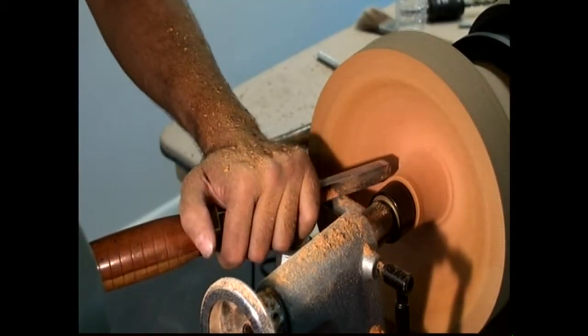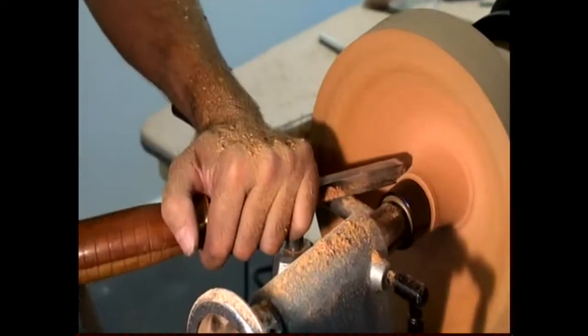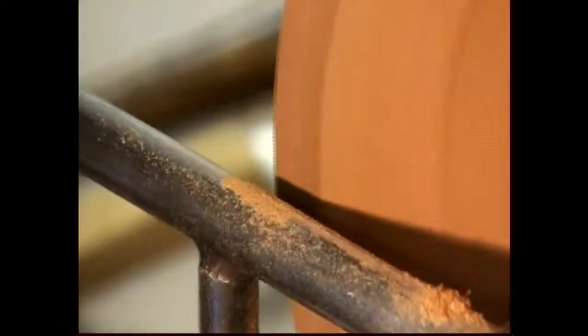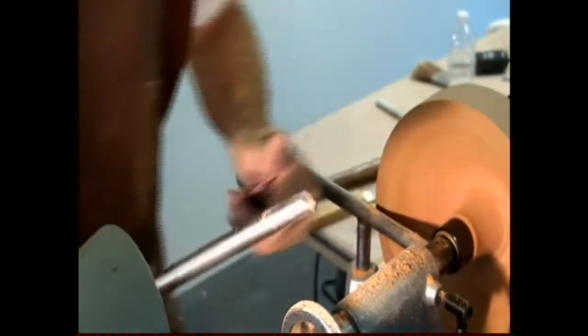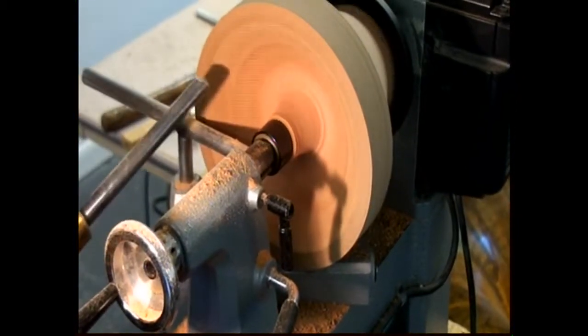Using the gouge in a scraping mode, this surface here has to be 90 degrees or less when it touches that wood. You get up that way, that's where catches occur. But over here, it's real safe. Same on this side. If that top edge on the bowl gouge is about 1/8 inch away, it's real safe. If I get up about 1/4 inch away, that edge is presented at such an angle. Scraping, it scrapes. You get too high up and it wants to dig in like that. So you either be on the bevel or completely in a scraping mode.